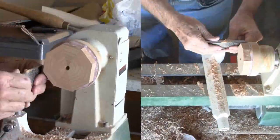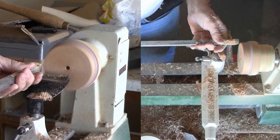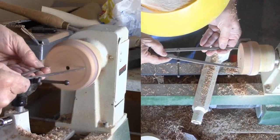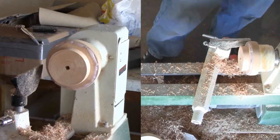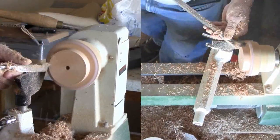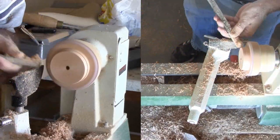Next, I'll mount the smaller ring onto the lathe. Now I want to make a tenon that will fit that mortise. I'll start with a coarse measure, then work it down little by little until it fits. I'll take it easy as I don't want to overshoot. I'll cut it close, put a chamfer on the end, check for fit, then repeat until I have the fit ready. I'm continuing to use a square carbide cutter, although a square nose scraper would do as well.